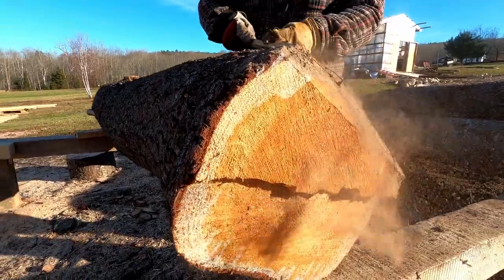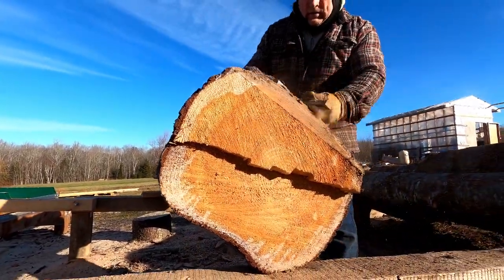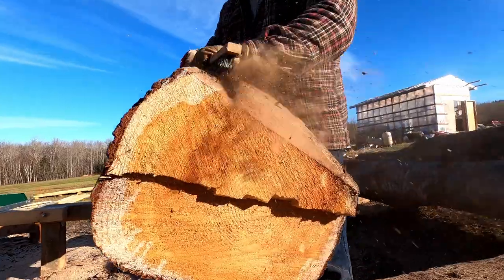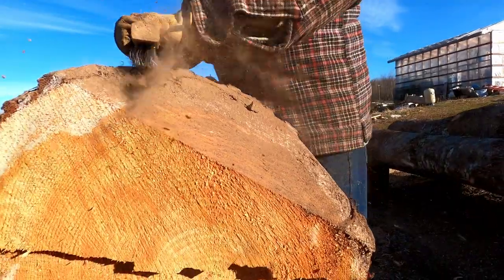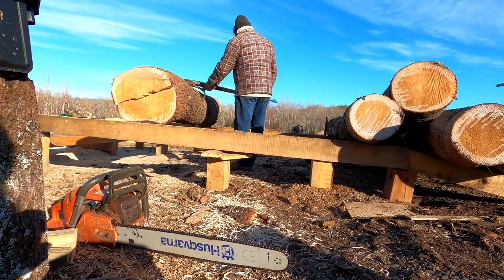We have a lot of mud, we've had a lot of rain, so we've had to take the time always to use the wire brush to get the mud off the logs, because if your blade goes through that, it'll dull your blade. Every time you would go through it, you'd be forever trying to mill a log because you'd be putting new blades on all the time.